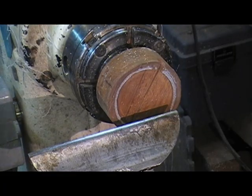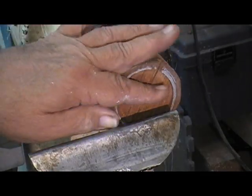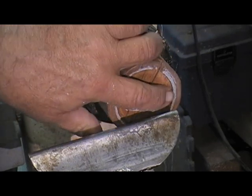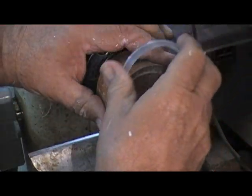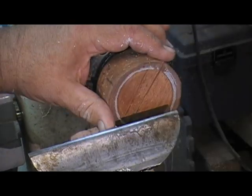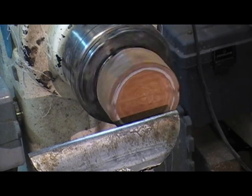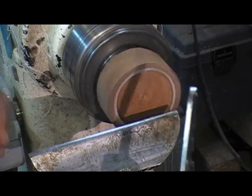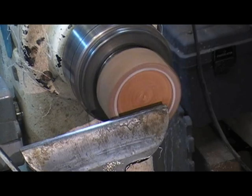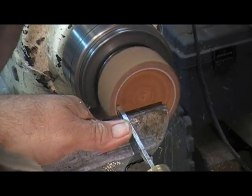Turning it around. This is a jam chuck. Almost right. This is just a glue block. And if you can see, there's a ridge. See the ridge right there? Well, that ridge is what this is going to fit into. Now, I turned something earlier today, and it's close to the right dimension. But we're going to have to fine-tune this to get it right. We're going to fine-tune it at probably about 1,500, 1,800 RPMs. And we're just going to true up this inside edge.